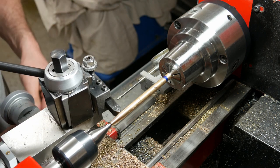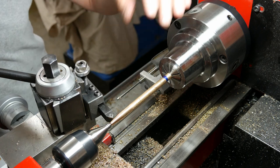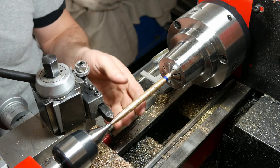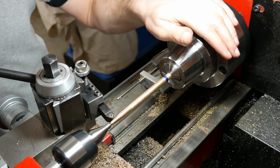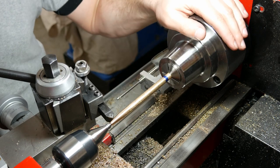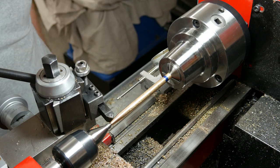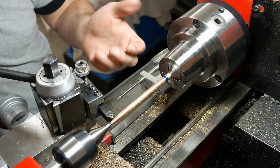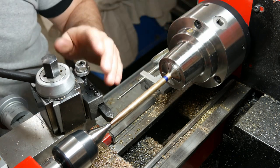Okay, so what I've decided to do was, I've gotten it apart, might have already told you guys that. I played with it a little bit, and it's too long based on my original design, and I'm not going to get all these little nicks out, because this bar's just been in the shop too long and it's been beat up. So I'm going to take it from 3/8 down to 11/32, which is the next 32nd size down, the size that will fit my collet, so I can turn it around and do stuff to the back of the body. So that's what I'm going to do here.